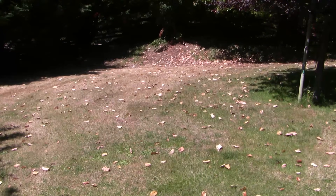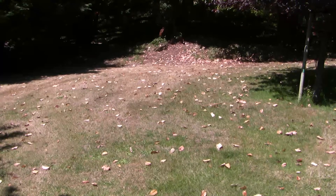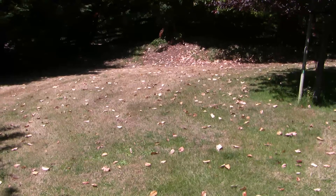Recently I had the solenoid in my home sprinkler system fail. I'm going to walk you through the diagnostic process as to how you diagnose a bad solenoid and how you swap it out. The way you usually come to this diagnosis is that you notice that one patch of your grass is all dry — it's just not getting any water and so you investigate.